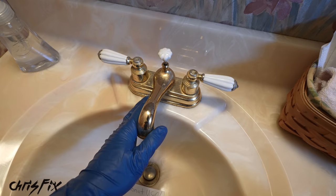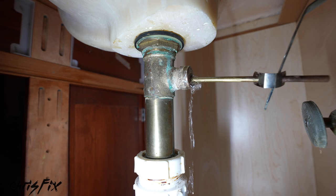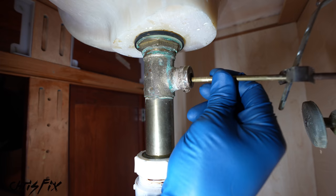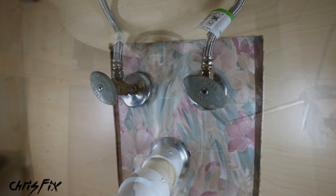Let's clean this out real quick so we can get under the sink. Now that we have access, let's turn the water on so you can see how bad this is — and that's leaking pretty bad. Even though we only ran the water for a few seconds it's pouring out. It's leaking from this pivot rod right here, which opens and closes the drain in the sink. So in addition to replacing the faucet, we're also going to be replacing this pipe, which comes with the kit.